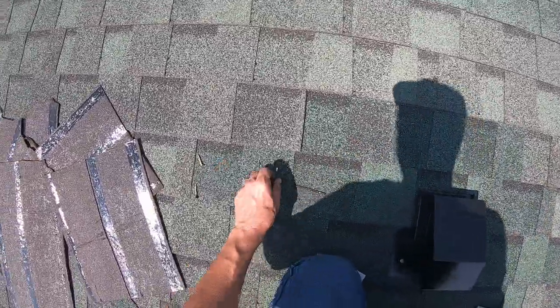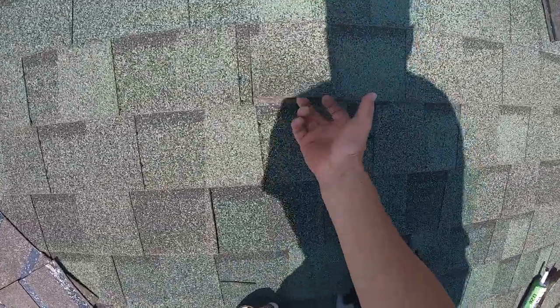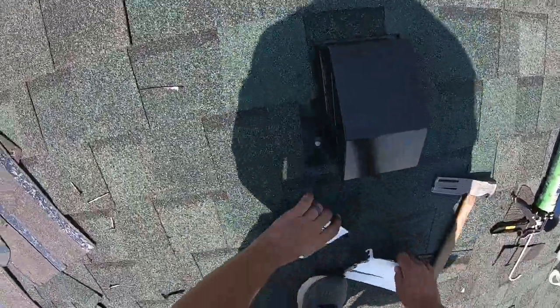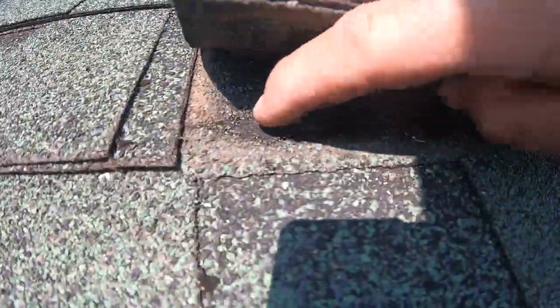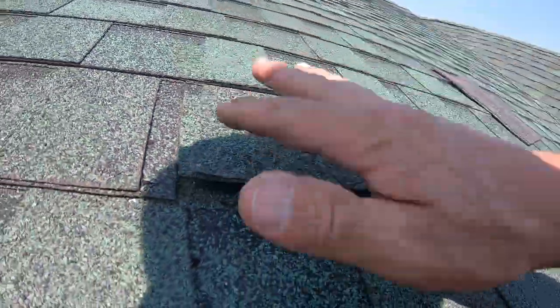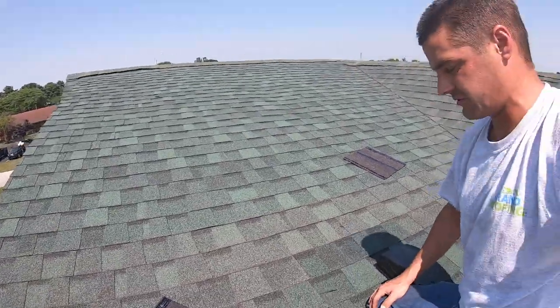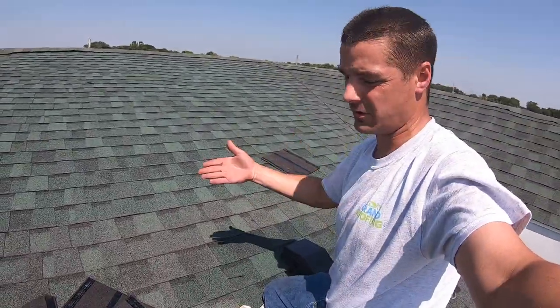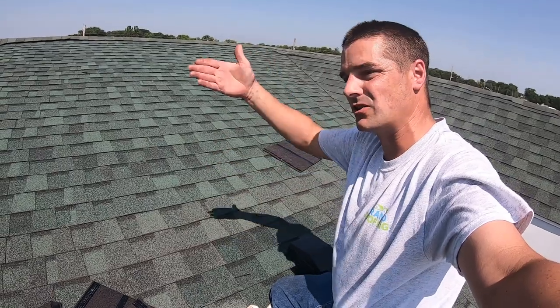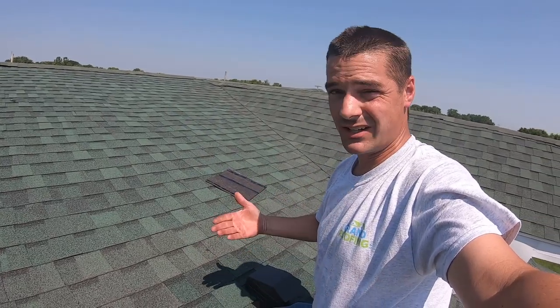The new shingles are going to stick down — that's not going to be an issue. Anywhere you split a shingle, it's not going to reseal, especially when you have this mat transfer where the granules have ripped off and are sticking to the tar — that's never going to seal down. A lot of guys do a 3-tab repair for wind damage, throw a new 3-tab in, but never seal the things around it that broke — and the next windstorm, they flap and blow off.